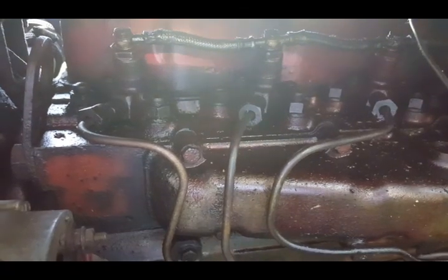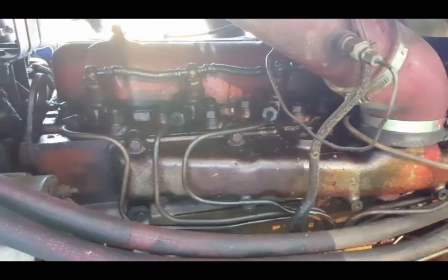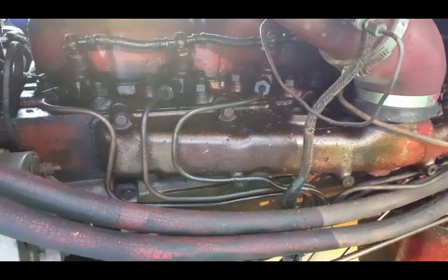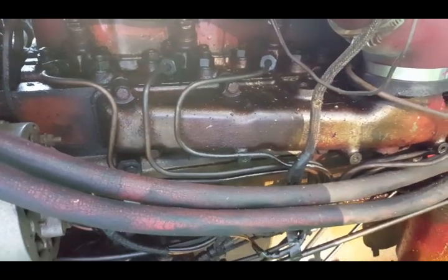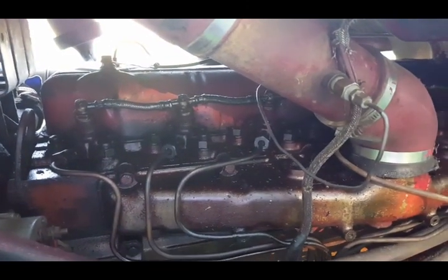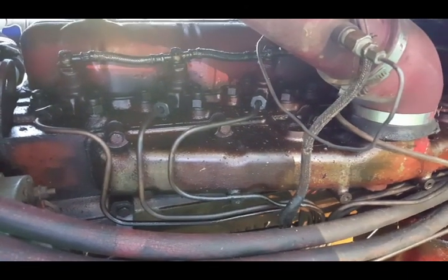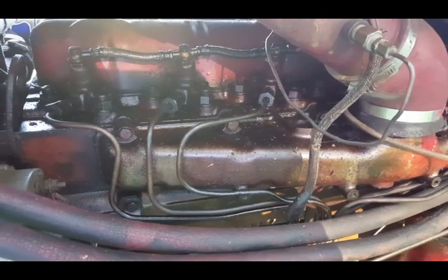The way you adjust that exact spring pressure is by a cap that is under here. Take this off, and then there's a cap that goes over the spring, and the tighter you put that cap, the more difficult it is for the diesel to squeeze through, which would delay your combustion timing, I guess. And if you loosen that cap, it's easier for the diesel to squirt through, and so your diesel would squirt through a little bit sooner.